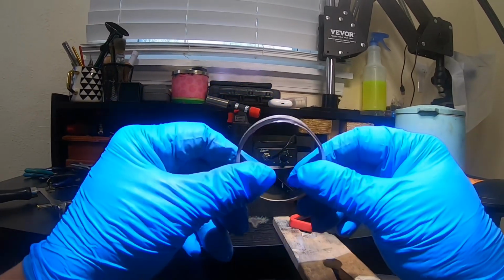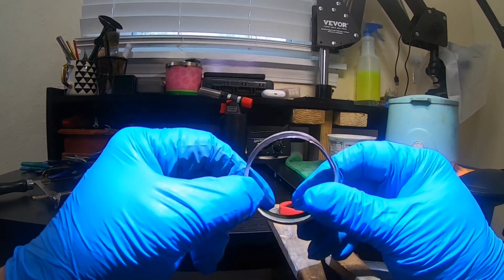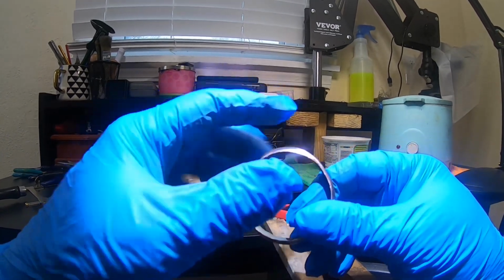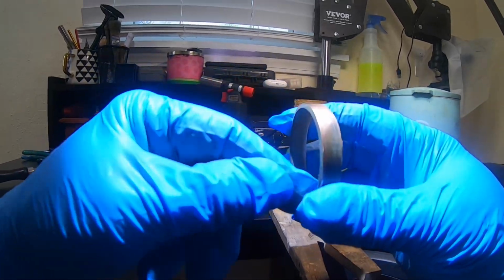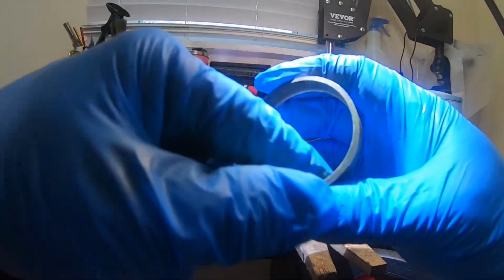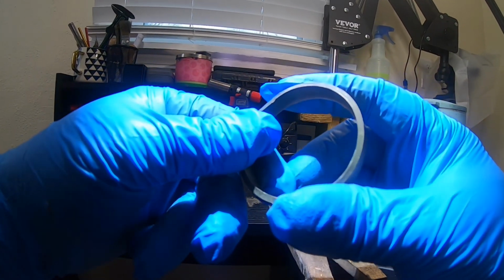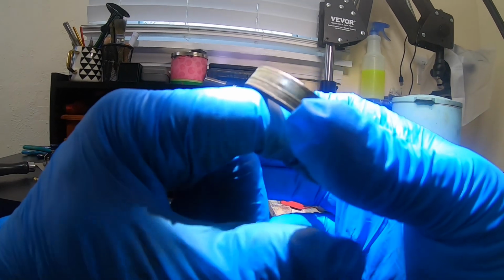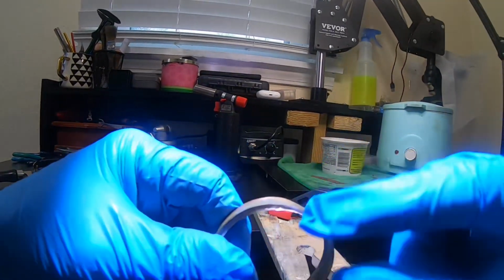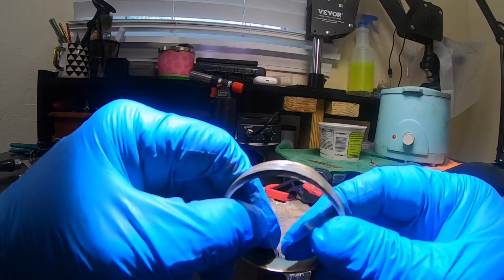All right, guys, I got that piece of 2-inch cut. I'm going to go ahead and cut this thing in half, get it annealed, and get it pickled so that it's nice and clean so I can roll it through the rollers, because the inside from where my cutters cut it has some raised spots right there, so we need to get that thinned out, maybe a millimeter, 2 millimeters thinner. But we got some nice thickness, and that's what I'm needing for this particular project, because I have an idea that I hope is going to work.